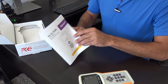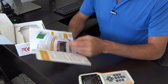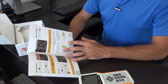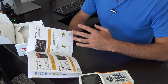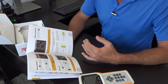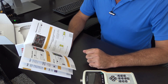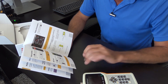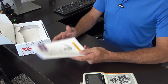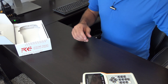Rig Expert does a great job with a color illustrated manual that shows you all kinds of parameters on what you can do with this thing. You could use this for a rapid checkout of an antenna, tuning into resonance — because you don't want to mask a poor operating antenna with a tuner; you want to tune the antenna for optimal performance. Having an antenna analyzer will make you most resonant and accurate in HF, VHF, or UHF depending on the model. And if you make coaxial stubs or matching stubs and need to know the capacitance and inductance, this device will tell you.